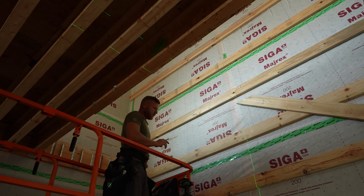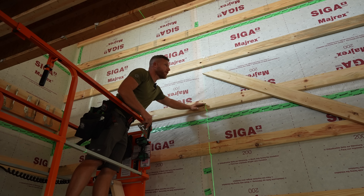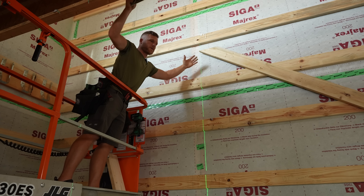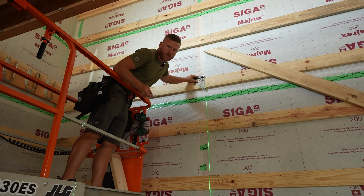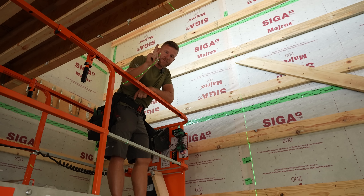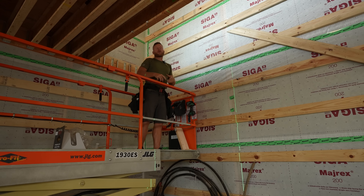We put this board on with a laser — the top of the board is the bottom of our floor system. We've got a column right here and we're going to have an LVL setting directly here. Actually this is just going to be a rim joist. While I have this here, I should probably mark where the top plate of this bathroom wall is going to be — thinking ahead.